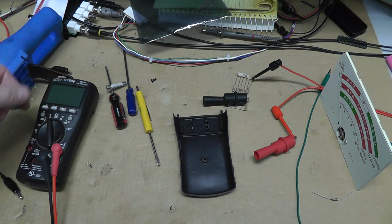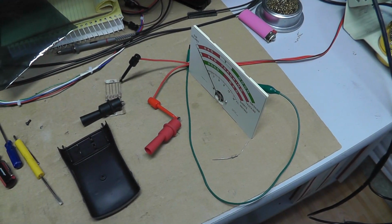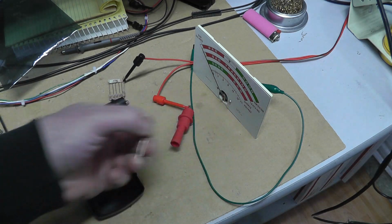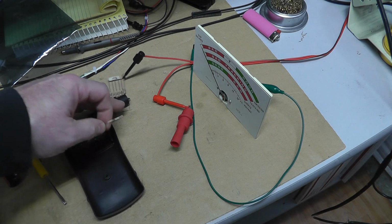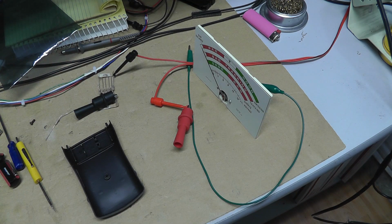All right, distracted. Anyway, I know that my little test was working, I think, but my meter wasn't moving at all. And it's supposed to be 200 microamps. I even tried it with a 1K resistor as well. Right here, you see that. So, instead of a 10K. That's it.